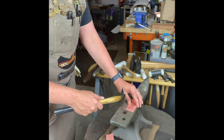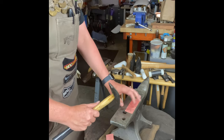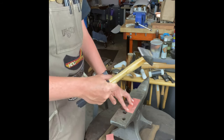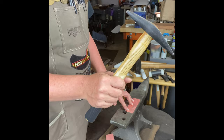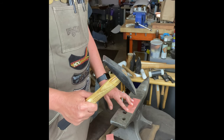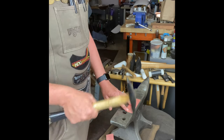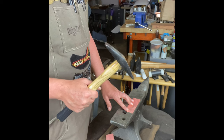I'm going to take this to the edge of my anvil, because I don't want my metal hammer to be striking the anvil — that's very bad for it. So we're going to do it on the edge of the anvil and hammer just gently. You can start in the middle and work your way down and then go back to the middle and work your way up. Now, one important thing about hammers is your grip. You don't want your thumb to be on top of it — you want your thumb to be on the side, and your grip to be fairly loose. You're going to lift and drop, lift and drop, lift and drop. The bounce off of the metal will help lift it at a reasonable height. If you do this correctly, you won't damage your elbow, you won't damage your wrist, and you'll be able to do this for a very long time. Use the proper ergonomics with your hammers, otherwise your neck is going to get sore.